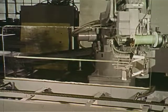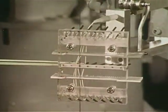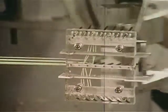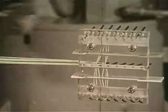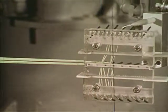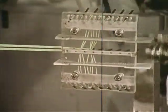The wire harnesses for our NC controls are made by hand. A worker, working from a wiring layout, manually strings the wires along a predetermined path to a fixture, thus generating the harness. Here we have taught the robot to do the same thing. With simple tooling resembling a fishing reel, the robot rapidly strings the wires from point to point along their proper paths in the fixture. This is an excellent example of the straight line motion by the robot.